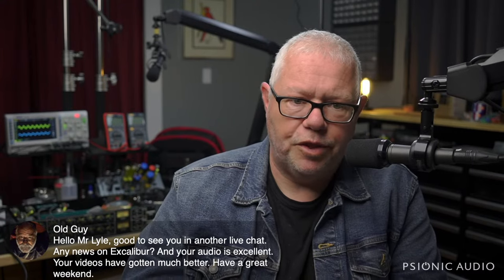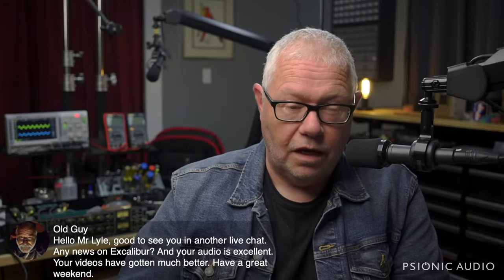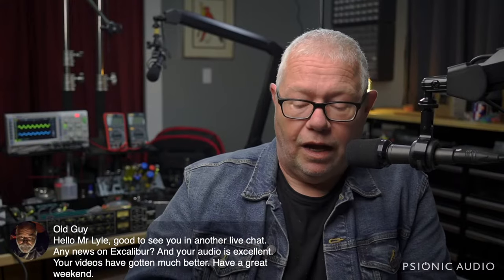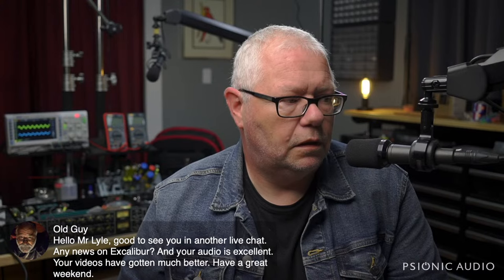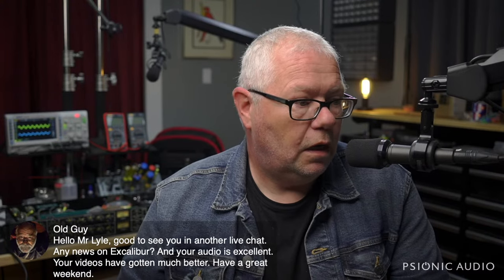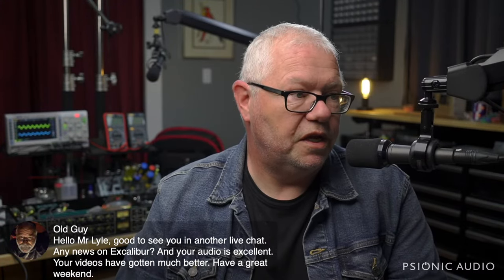And the audio is excellent. Thank you. I did tweak the audio for today's stream, and I changed all the lighting settings for today's stream. I think I'm getting better at this. The audio change was just I high passed at 130 hertz. Is that right? Or 150 hertz versus 80? Let's see here. I know this is riveting stuff. It's 160. So I'm high passing at 160 hertz versus 80.